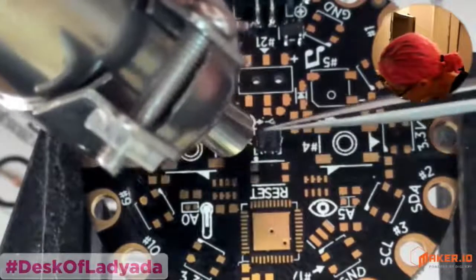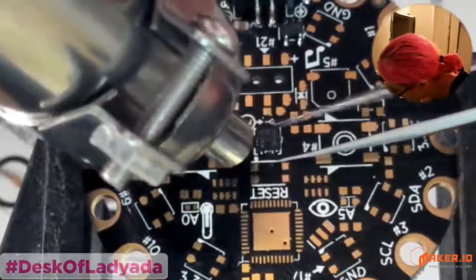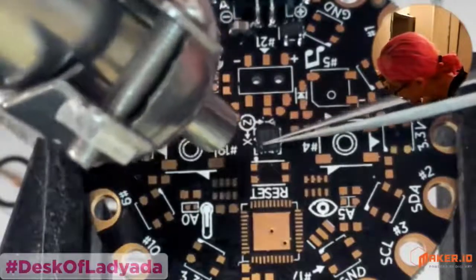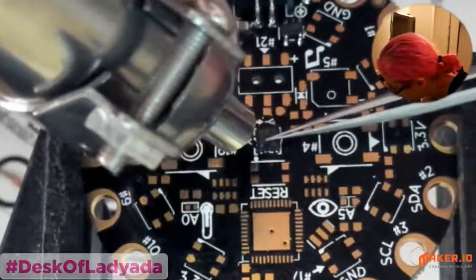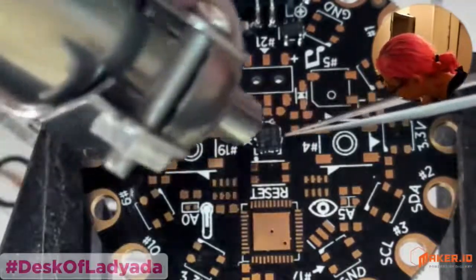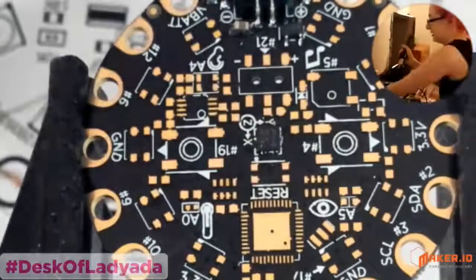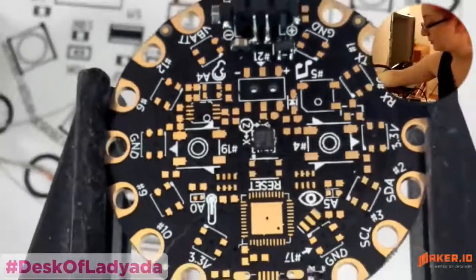That's electronics. Another nice thing is it will center itself. When you push the part around, it'll actually self-center. And if you push it down, it'll squeeze all the excess paste out. So you kind of have to push and squeeze a little bit. This is getting a little bit weird, but that's what you've got to do. And that's it. That's hot air. It's a good tool. You want to use both.